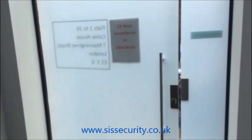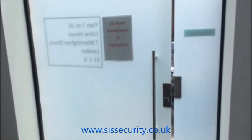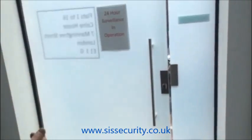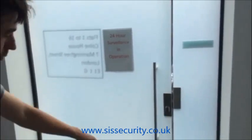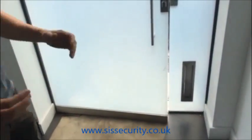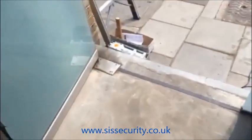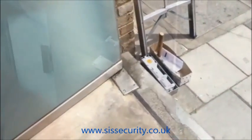It's quite windy today and you can see it there struggling with the wind. Sometimes it will pull shut but most times it won't. You can see it still pulling a little bit, so what we need to do is change the floor spring for a bigger one and then that will control the door and make it close and open.